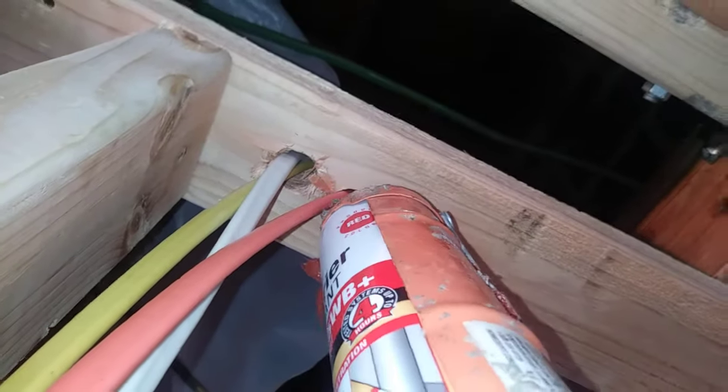We've got another one here that's creating an updraft — it's an opening. You want to try to get it around both sides if you can, and the same thing up in here. If you're able to wrap both sides, that's fine; if not, you can just encase the whole thing and the inspector will be happy with that. See the void in the white wire next to it — you want to make sure it's filled because he will fail it for that. Just stick your nozzle back in and give it a shot; it doesn't have to be pretty but it does have to be filled.